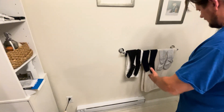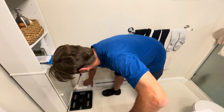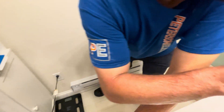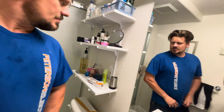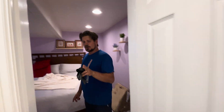So if you're going to put a baseboard heater in a bathroom, you can. You usually need to maintain about 36 inches from the shower. You can do a unistat on it. And then if you have a plug, any plug in the bathroom that's plugged in has to be GFI'd. This is a dedicated circuit because this receptacle right here is part of all the other plugs in the basement — that doesn't work. So she can do her hair dryer here. But if you have any plugs above a baseboard heater that's electric, not radiant, you cannot have them directly above it.